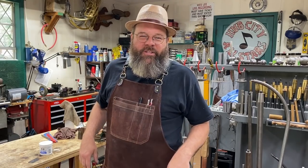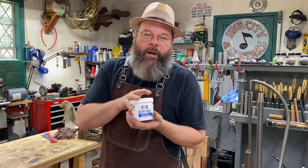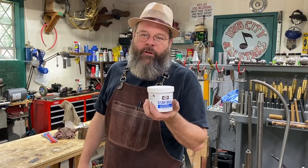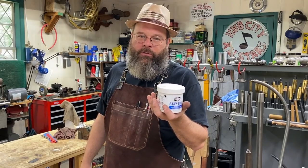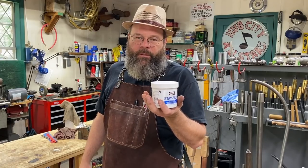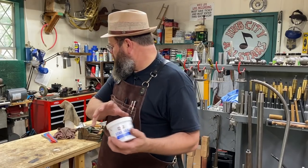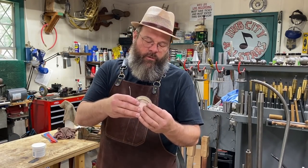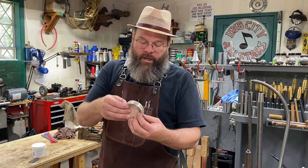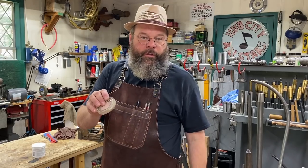All right, while I'm getting set up, I'll break in and talk about Harris. This is the silver solder flux that I use. This is good brazing flux. This goes from 800 to 1600 degrees. So this is what we use. This is the silver solder I use. Also a Harris product, Stay Silv, cadmium free. It's part number F200.